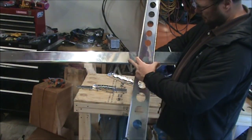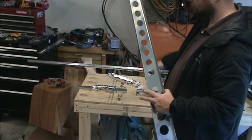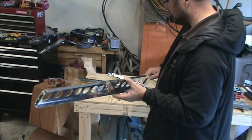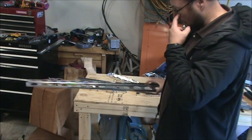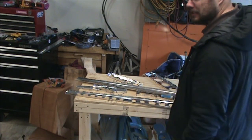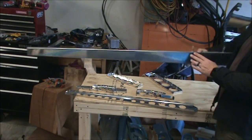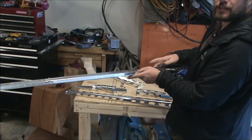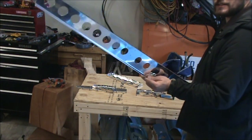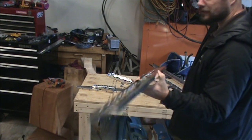Now I'm thinking, if it doesn't say it somewhere in the next few instructions, that it probably just was kind of glossed over, or I need to go back and read it again, maybe I missed it. I definitely know it's not in one of the steps I checked off. The holes here get machine countersunk, or some holes in here get machine countersunk and deburred later. So I didn't see anything about this yet, but I'll set it aside. And if I get to the point where I'm about to rivet something together to this, I'll just make sure to deburr it then. But it does appear that when they say deburr just the rib holes, they mean just the rib holes.